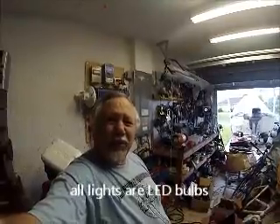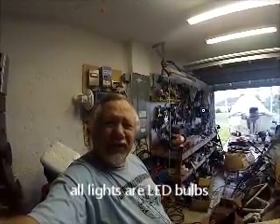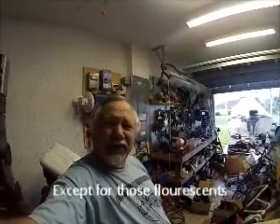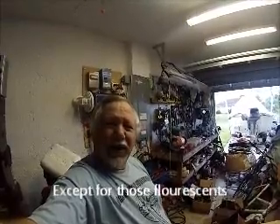People running 12-volt systems with a 12-volt inverter and a couple of deep-cycle 12-volt batteries aren't going to get too far. With everything on I get about 24 hours taking them down to 60%, and hopefully I won't have to do that very often — but we did it during Hurricane Irma, no problem. Anyhow, battery life: you've got to have at least some decent batteries. These are kind of marginal, but they get us by.